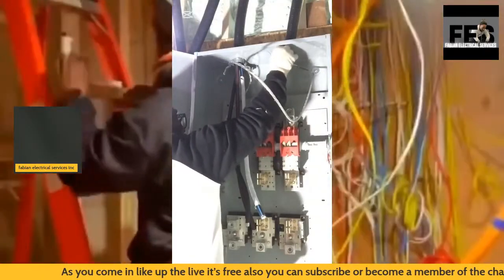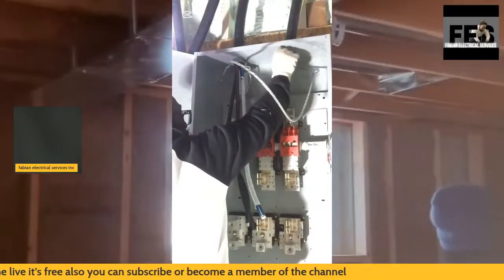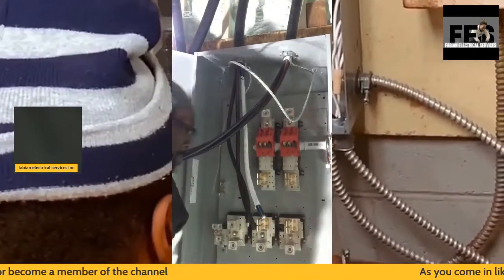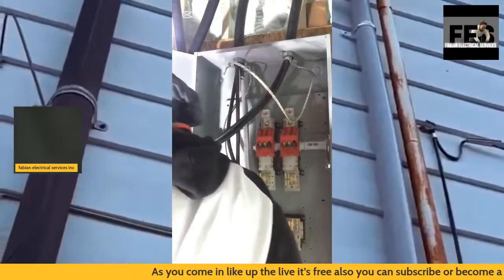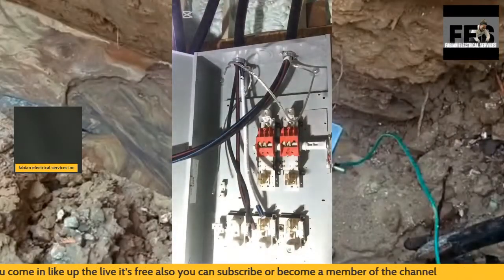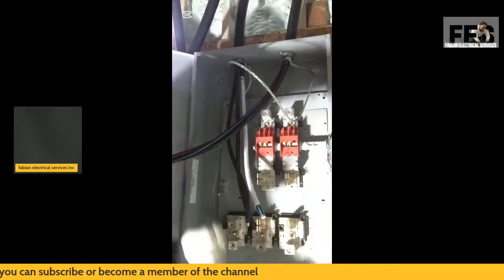It's always best to have your line and loads coming in separated. Never have them touching each other. It is a code compliance rule that states that your main feed that's coming in is not supposed to come in contact with your actual load side that's going out. So for this reason, you're going to see the installation.